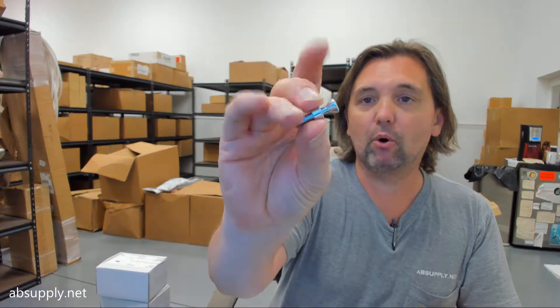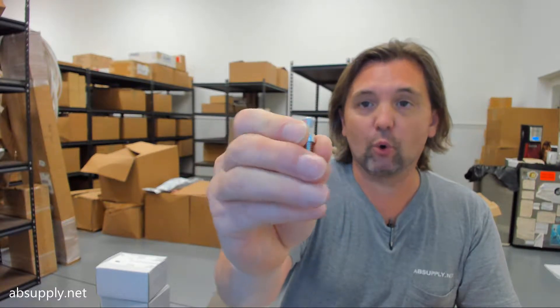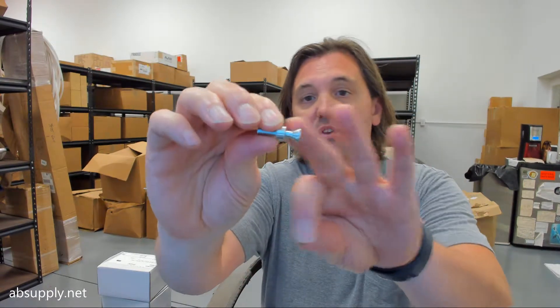This is a quarter-twenty cone-head wood screw, and this replaced — or is the new version of — the SP1029. It's now a two-part system where this is a bolt that you can use to drill and tap into a steel or aluminum door that's been properly reinforced, giving you the cone head for installation.